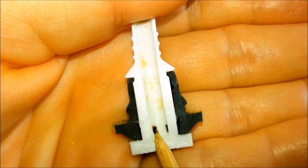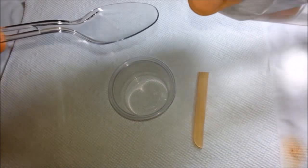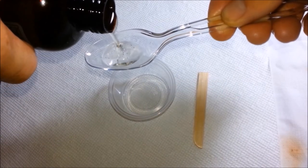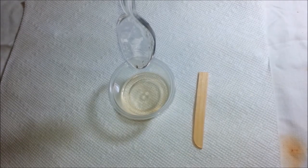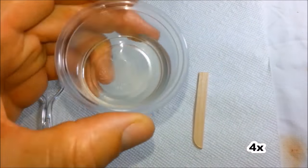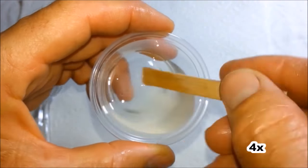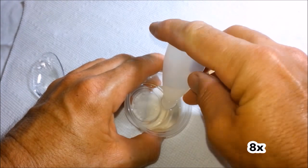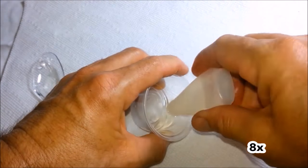To keep polyurethane from curing the valve ports, I mix mineral spirits and castor oil. A mix of about 50% castor oil and 50% mineral spirits works pretty well. The mineral spirits kills the foaming action and thins the castor oil so it can easily get beyond the small ports in the sides of the valve and mix with the polyurethane without stirring. Eventually the solvent will evaporate, but the castor oil remains and keeps the polyurethane from curing.